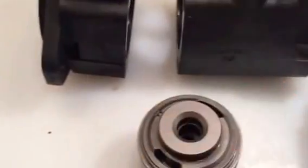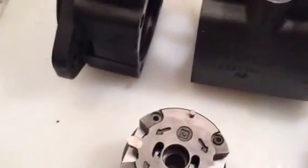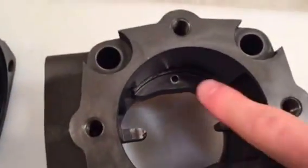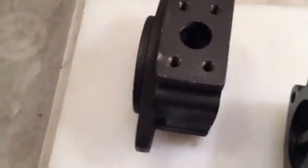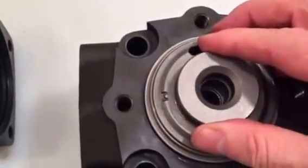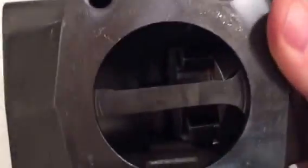The important part is on the inlet side of this main cartridge. When we look at the rear, you'll notice there are two dowel pins in this cartridge kit. Looking down inside the housing, you can see a dowel pin hole here and a dowel pin hole here. If I take this cartridge kit and put it in properly, I drop it in so the dowel pins seat.